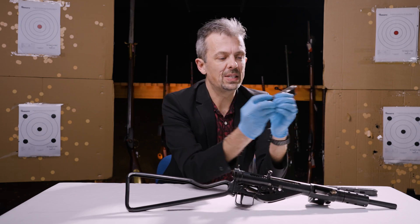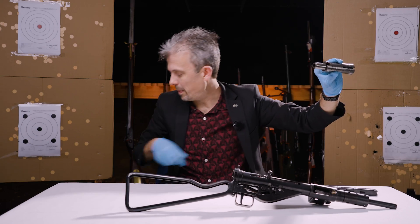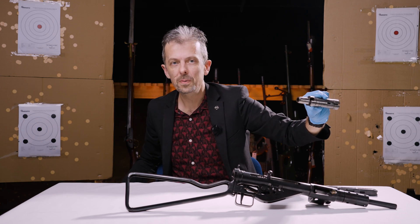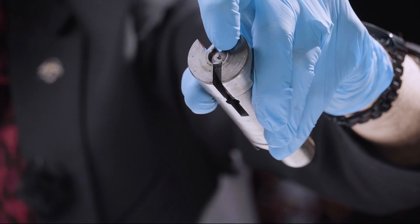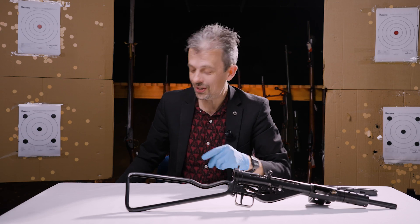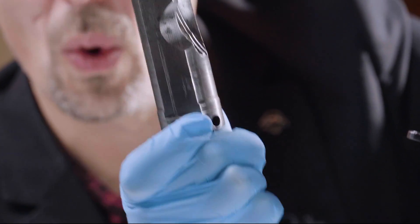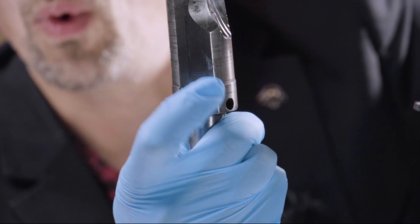All the trigger is doing is stopping the bolt. There's the ledge on a different bolt — so it sits in the gun like this. The cartridge is picked up from the magazine at the front of the bolt, and the spring fits over the back. You really just need two tubes — the barrel and the receiver — and this setup. It's so simple, one up from a slam gun: just two steel pipes with a bit of ammunition in the middle and a fixed firing pin — a little pointy steel bit that crushes the cap, fires the cartridge, and starts the whole process going. That's the basics, and the beauty of both World of Guns and the actual cutaway is you can see that happening.